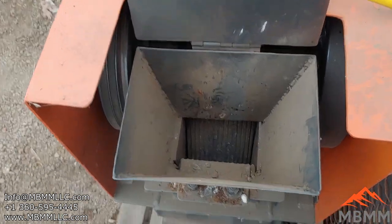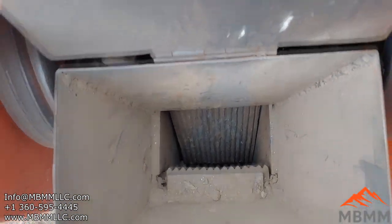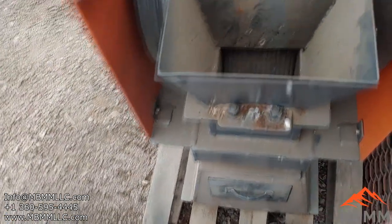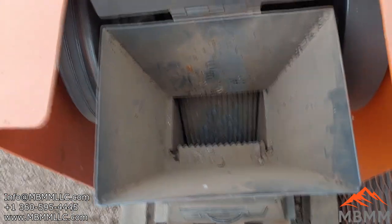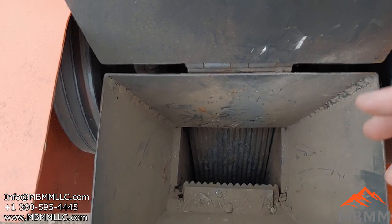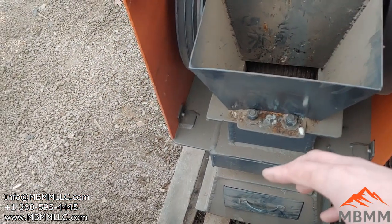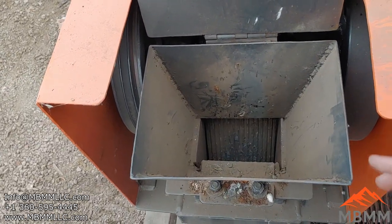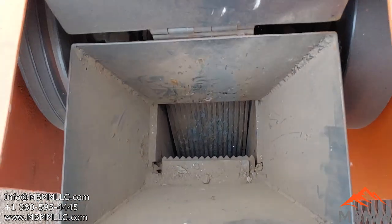So next thing we're going to do is run it down this little 4-inch by 6-inch laboratory jaw crusher. It's going to crush down and go in this drawer here. It crushes down to about 1/4 inch, 3/8 minus. I know there's a lot of free gold in here and maybe some really nice specimen stuff. So I'm going to crush it into the drawer, spread it out on the table, and see if we can find anything that's really good, high-grade stuff that we can take out as samples. And then the rest we'll deal with some other way.